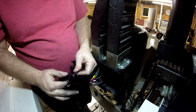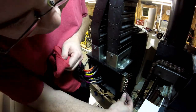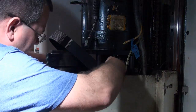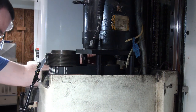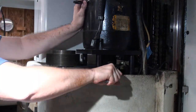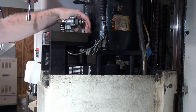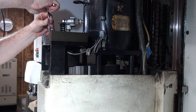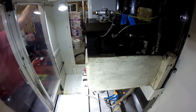Now we just put an initial layer of electrical tape on and leave everything untucked until we run our tests and confirm everything's good, then we'll wrap up more electrical tape and tuck it all back in. We put the grease fittings back on and start reassembling the head. We put the belt back on — to tighten it, you put a dial indicator on the nose of the spindle pulley and want about 5 tenths of deflection when you tighten the belt. Then we put the drawbar bridge back on, the drawbar piston, reconnect airlines and the electrical connector. Very important: you must remember to unblock your counterweight — don't forget those blocking bars or you can mess up your machine. We remove the bars and run the spindle incrementally all the way up to 7,500 RPM, and it all ran good. Then we finished up by reinstalling the sheet metal.